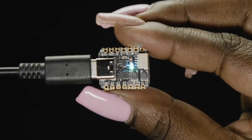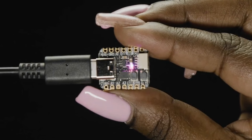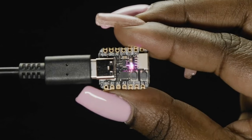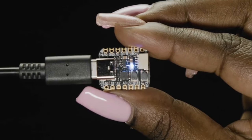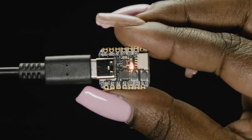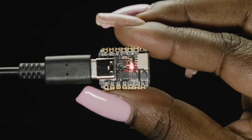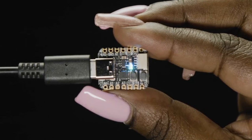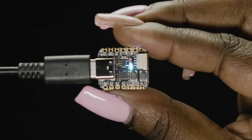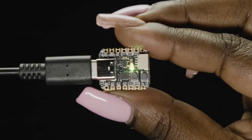If you want to experiment with the CH552 or use a 40-cent microcontroller in your project, this board makes it fast to get started. We recommend the ch55xduino board support package, which lets you program via the Arduino IDE. However, it's not Arduino compatible because the compiler is C, not C++, which means Arduino libraries won't work. We do have example code for things like NeoPixels or reading from I2C, but there's no Wire library or Serial dot notation — no objects because there's no C++ compiler.